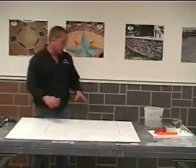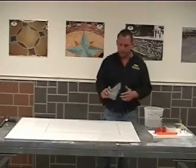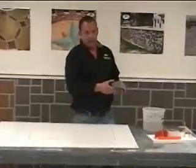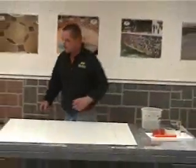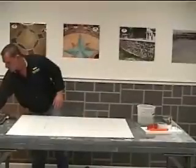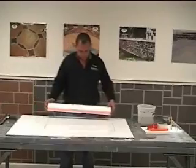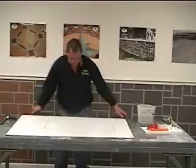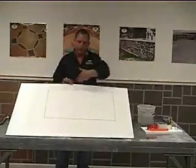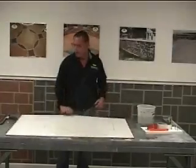So in this case, what I'm going to show you is the reduction method. Basically what it involves is casting a piece that looks to be 1.5 inches, 1 3/4 or greater, and actually it's only 1 inch thick. We'll start off using our front profiled edge. Now I've already got my outline drawn onto my casting deck. You can see here we're just doing a simple square. This will be our leading edge, or profile edge. That'll have the larger drop down.